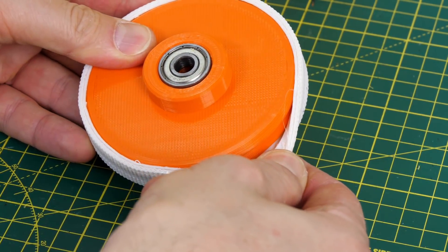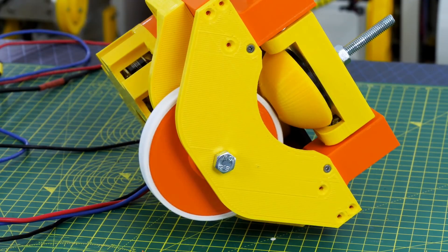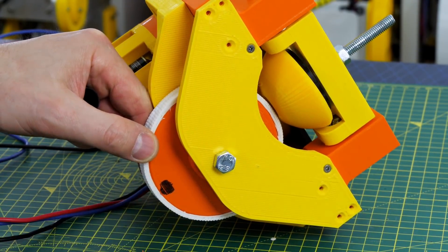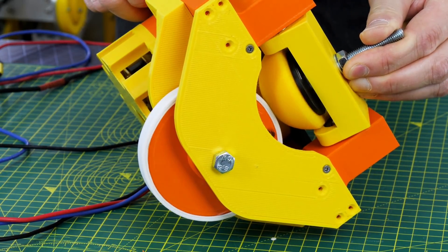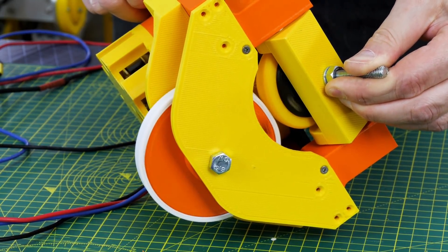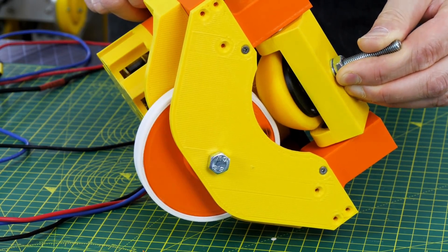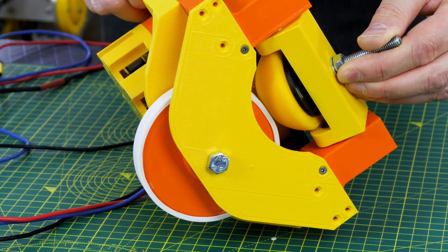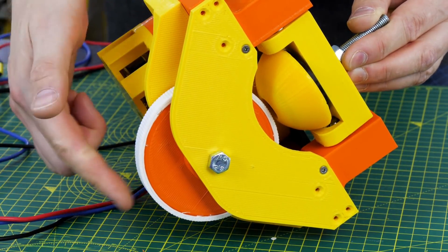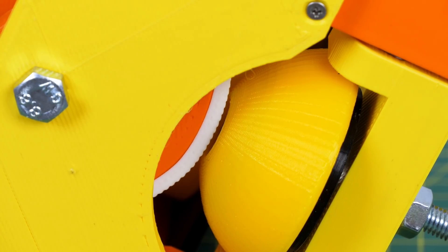The output will actually be the wheels of a robot — I've got a TPU tyre on a wheel with some skate bearings fixed in the middle and these fit on either side. With the motor running we can see a continuously variable reduction as I tilt the hemisphere. If I tilt it so the larger circumference is rubbing against the output wheel, the smaller circumference runs against the cycloidal drive wheel, gearing us up for a faster output. Moving it back the other way gears us down for a slower wheel. There's also a dead spot in the middle where it's de-clutched even though the motor is still running, because there's a hole in the bottom of the wheel.